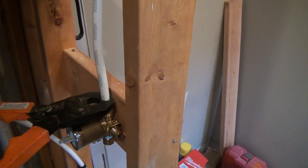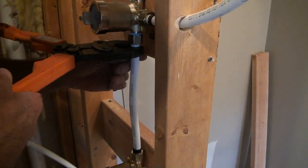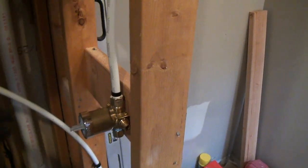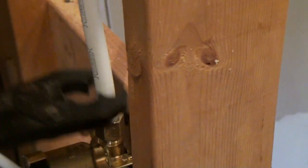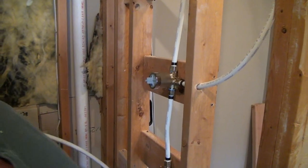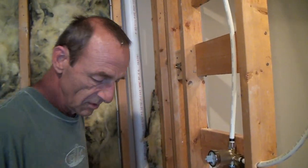All right. Crimp it on the bottom. Just gonna move it up a tad. Actually, you got 2 of them. I'm gonna go up here. The hell with it. Top ring. And our bottom ring. 1, 2 squeezes. All right. And we're flying through here as fast as he can put rings on and squeeze that PEX crimping tool. We're making watertight connections, and this turns a 2.5 hour job into about a 5-minute job.